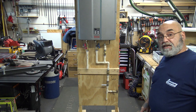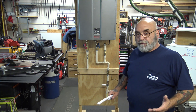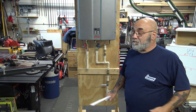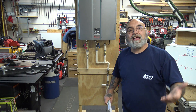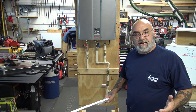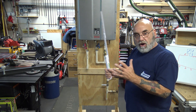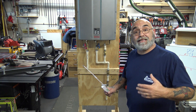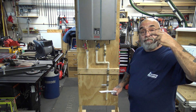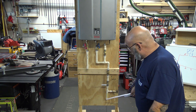Here is a typical installation. Every installation is going to be different because of where the cold water pipe, hot water pipe, and return line are. I've spread it out so you can see it — go ahead and freeze it and take a snapshot. When you disconnect either an older unit or a water heater with a dedicated return line, besides the gas, electric, and vent, you're going to find three pipes: cold water, hot water, and a recirc pipe.